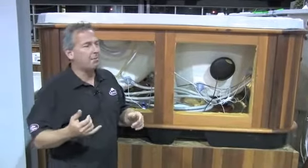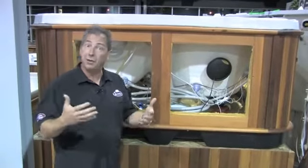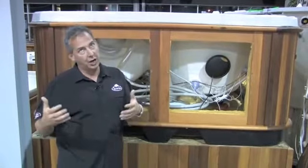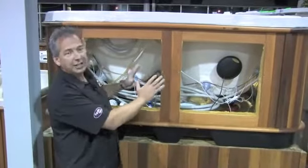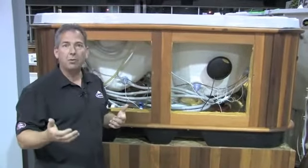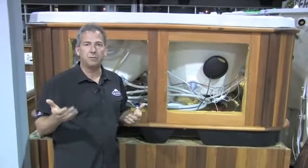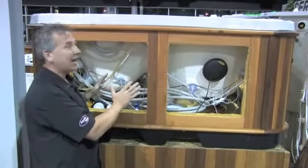In the event of a power outage, a pump fuse blowing, or a breaker tripping — and Murphy's Law says these things are more likely to go wrong in January than in July — if this tub shuts off in a freezing condition, the transfer of heat reverses. The heat from the water radiates back into the cabinet and keeps the cabinet at the same temperature as the water. In our studies at -20°C (about -5°F), this tub can shut off and you have roughly five days before anything underneath would freeze.